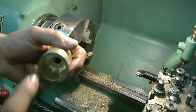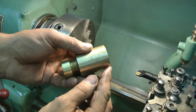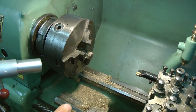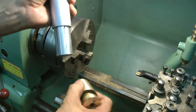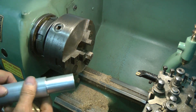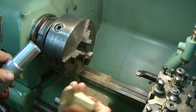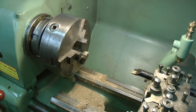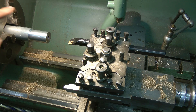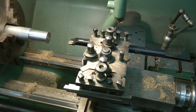I think that'll do us, that should be near enough. Yes, I'm very happy with that. It turns out light speed wasn't too bad at all — it got the job done. This has now got a three or four degree taper inside it. I need to get the male end into the female end — it's getting a bit risky, this video! Nearly, but it's not going to fit at the moment. So I now need to cut a four degree taper to match exactly that internal taper. My plan is, because I've still got that set up at four degrees, if I put this piece in the chuck and run the lathe backwards, it should cut on the back, thus giving me the exact same taper as the internal. That's the plan — I don't know if it's going to turn out, but we'll soon find out.